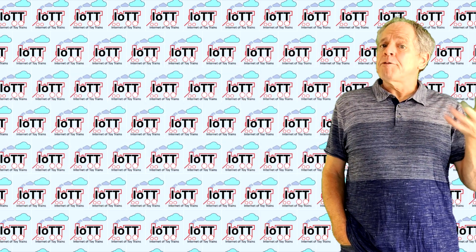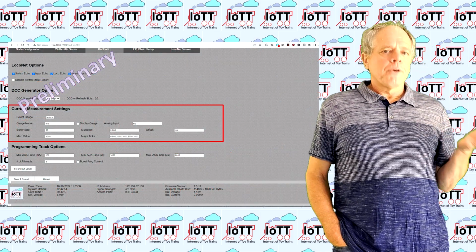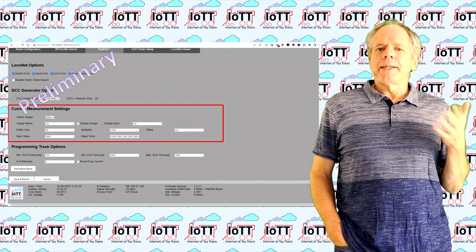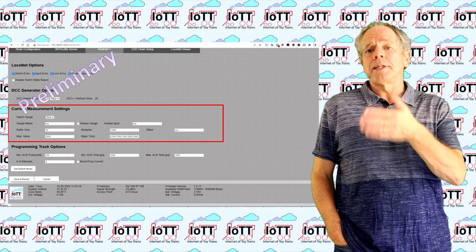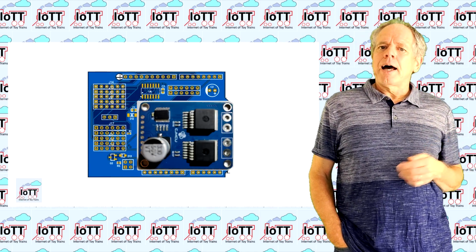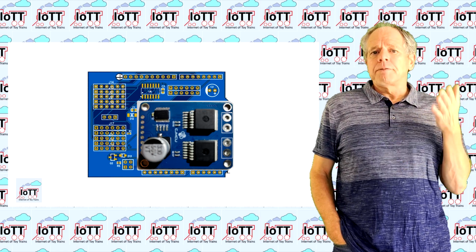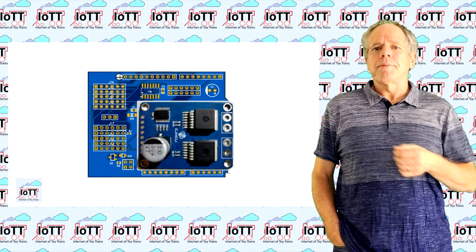Okay, so with that figured out, what's next? Well, 2 things. First, I am going to make a few changes to the current measurement setup of the IoTT stick, mainly adding the possibility to configure an offset to adjust the zero level of the display in case of baseline noise. And second, I am working on a carrier board for the no-cooler IBT-2 in the Arduino Shield form factor that will make this IBT-2 board a single-channel Arduino power shield.